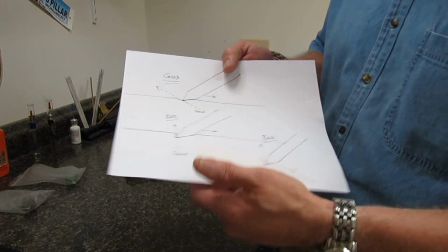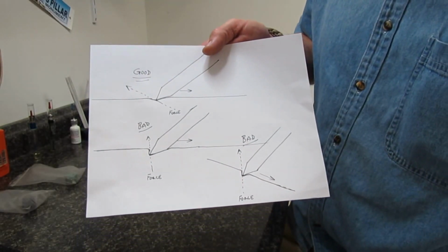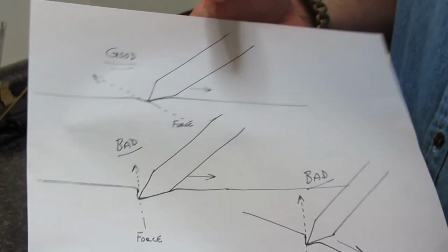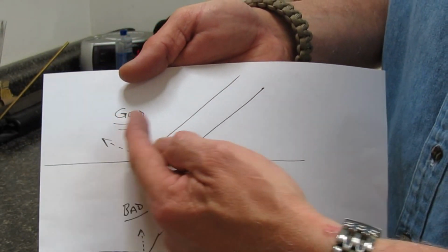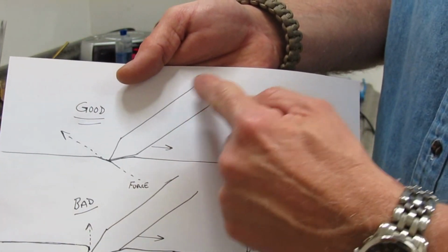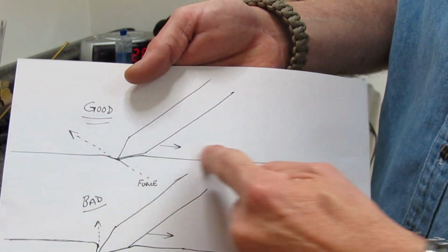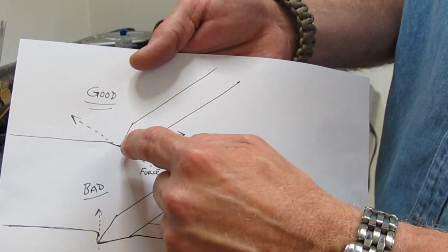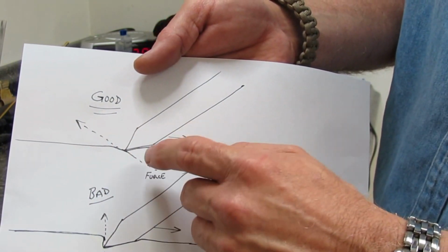First of all, I got another one of these awesome diagrams that are like impossible to decipher. Okay, what I've done is draw 3 pictures here. The top one kind of indicates good, what a stropping motion should do. Now here's a cross section of the blade, and we're pulling it in this direction along the surface of the strop. So as the knife comes back, pressing down into the soft pliable leather, it should create a depression that looks something like this.